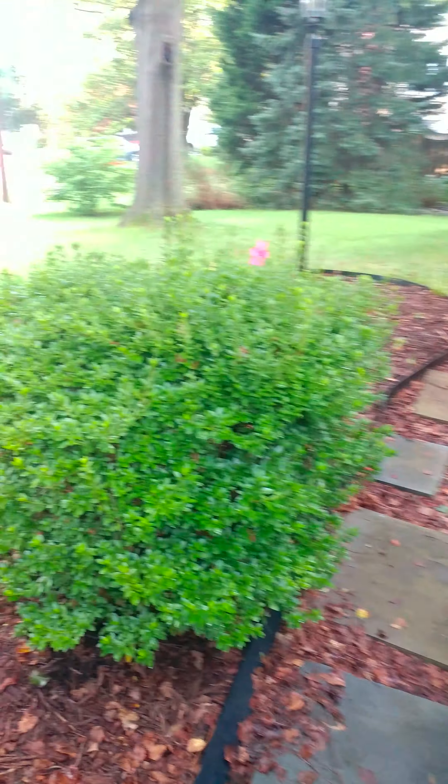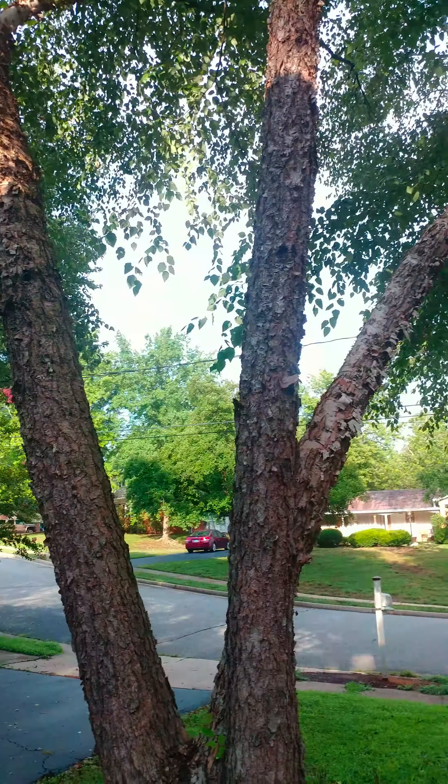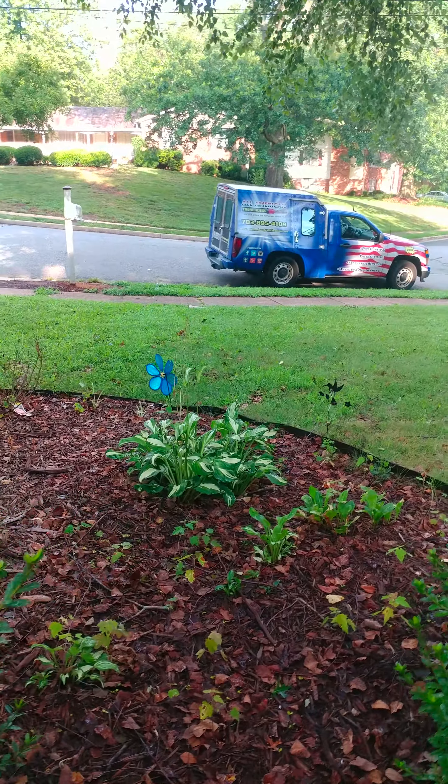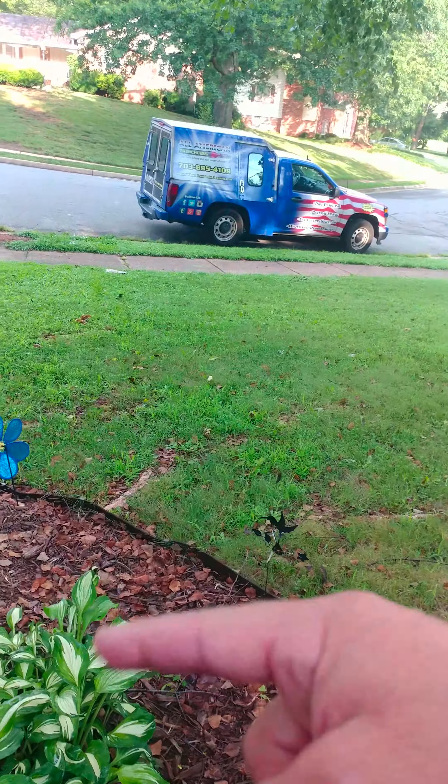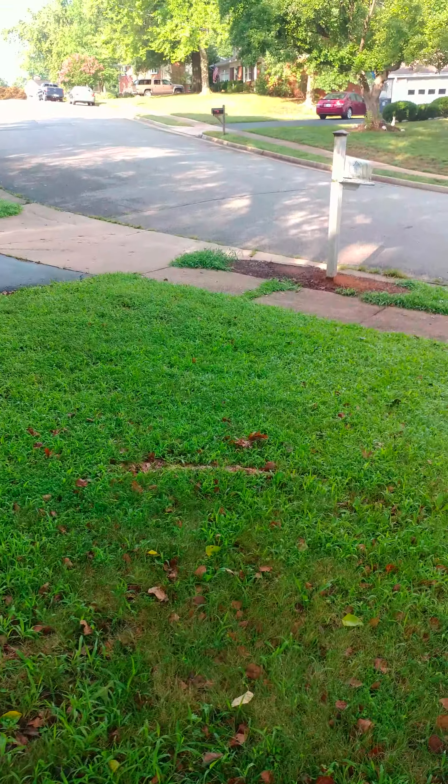The full line replacement will require us to be really close to this tree. They should know that this tree will likely die because of the surface roots we'll be cutting through — there's one here, one there, one over there. We're not going to cut through the one over there, but it does branch right through the trench.